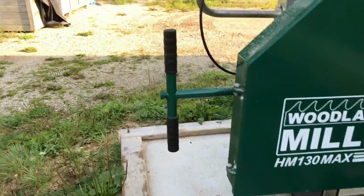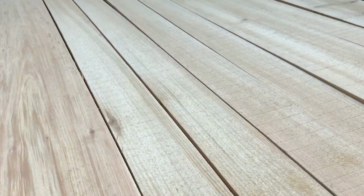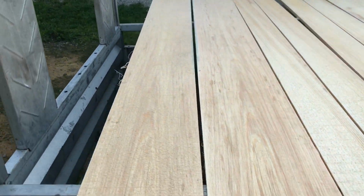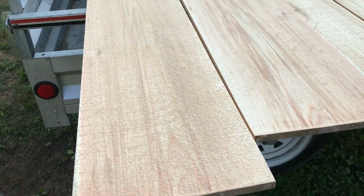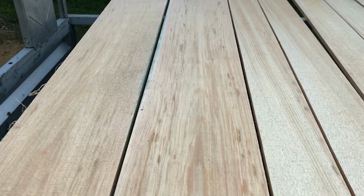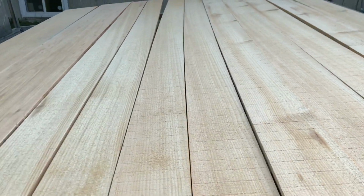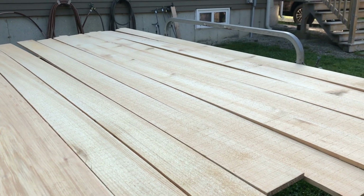I had to cut some, here, I'll show you. A friend of ours wanted to do an accent wall coming down a staircase, which is all angled and stuff, so she gave me some measurements, and I had that other smaller cant, I milled that up, and well, I added a couple 12 inch boards here, but I'll show you that too. So I'm hoping she'll be happy with that. It's pine, and it's not a whole lot of knotty pine. There's some knots over there, but that just gives it character. But that's some from that 12 inch cant there. I don't think there's a knot in this piece right here. It's just beautiful stuff. So anyhow, I'm cutting that like 3/4 of an inch. I'll plane it down for her, and she can put it on her wall, and hopefully she'll be happy with that.